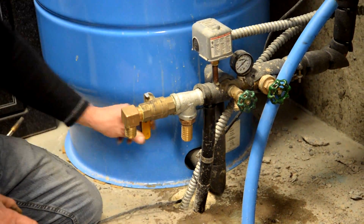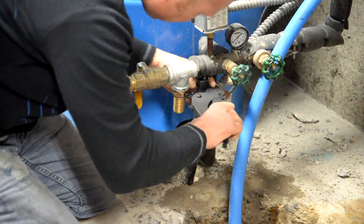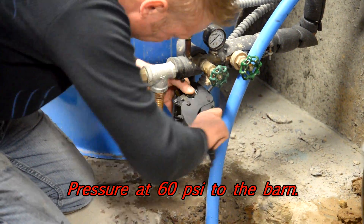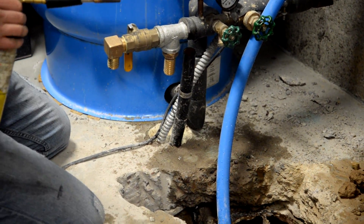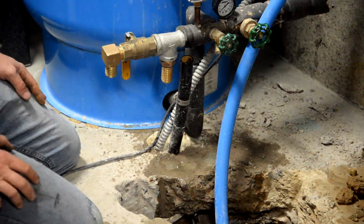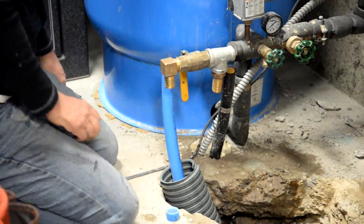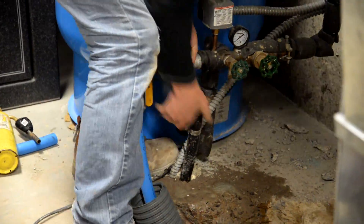Once that was in place, it was just a matter of heating up the water tubings, putting them on — these are fittings that go on fairly snug and once they cool down they don't really come off — then clamping for safety. We made sure the pressure was set where we wanted, which is 60 PSI to the barn, and then water tested everything. One nice thing about the horizontal approach: we don't have to register two wells with the county, and we didn't have to rip the farmyard up trenching all the way across.